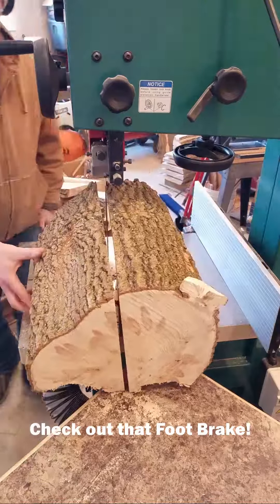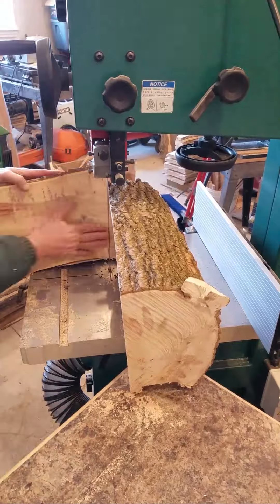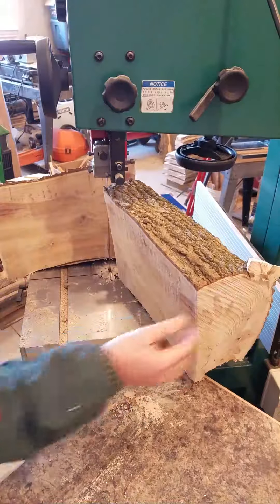You can see at first I do a first quartering cut. The bottom was pretty flat so I felt comfortable doing this without a guide. If there's any wobble you really want to put a guide on there. So I've got one nice flat surface.